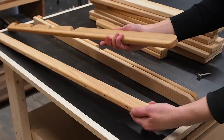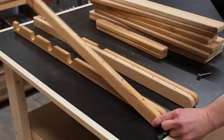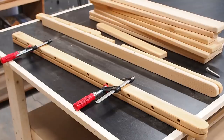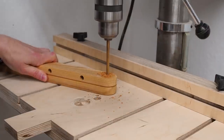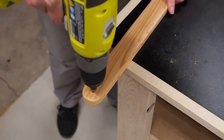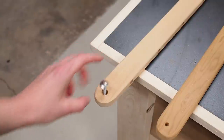With all of my pieces ready, the idea is that the back will be able to incline, so I need to make holes so I can assemble the mechanism using some bolts. I clamped both pieces together to make sure that the holes in both pieces will be perfectly aligned, and used the drill press to drill all the way through. I then used a large countersink bit to widen the opening so I could get the bolt flush with the surface.